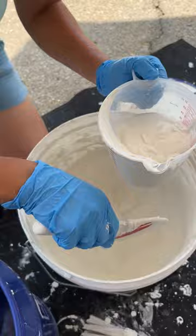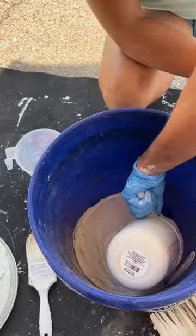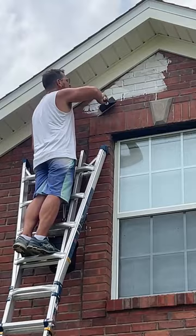We went with 50% dilution — that's two parts lime wash paint to one part water. And yes, I said that correctly: 100% dilution would be a 1-to-1 ratio. Dilution ratio and mix ratio are different things. Once we had our paint diluted and mixed, it was time to start lime washing. For the first coat on the first section, I ended up thinning even further, but that turned out to be unnecessary. So let's just pretend everything was done with 50% dilution.